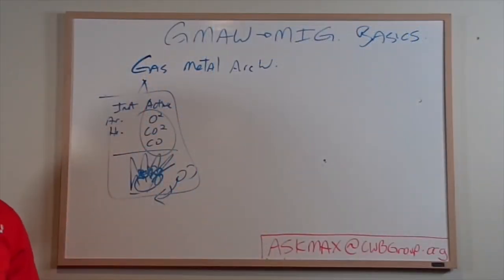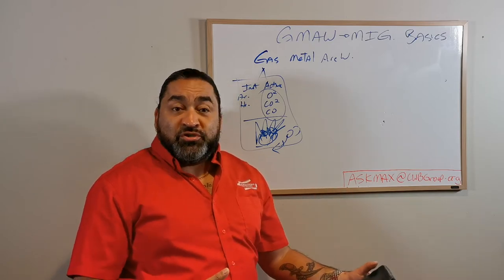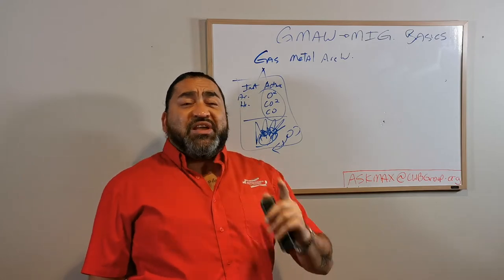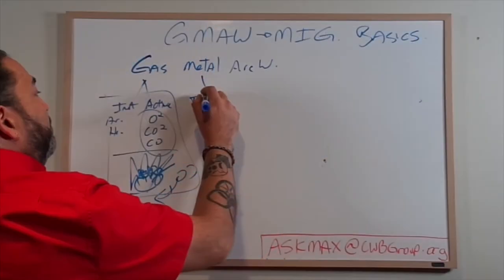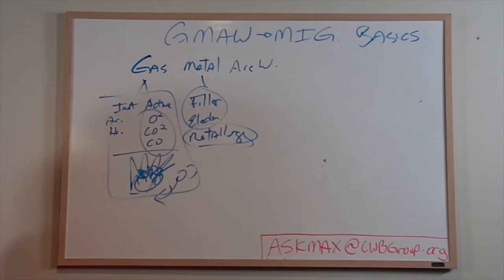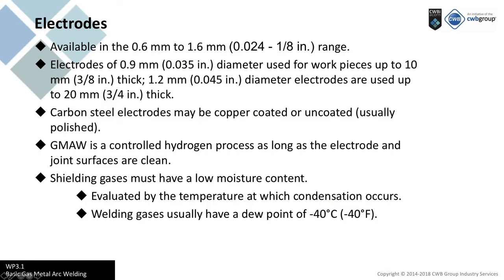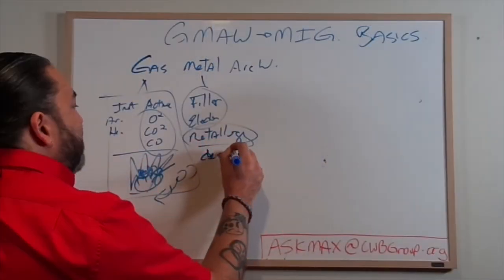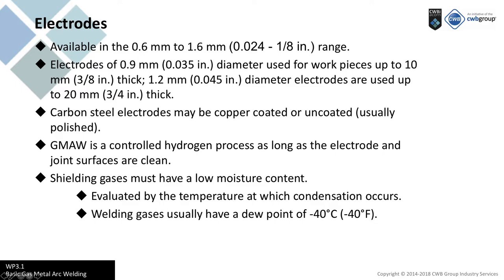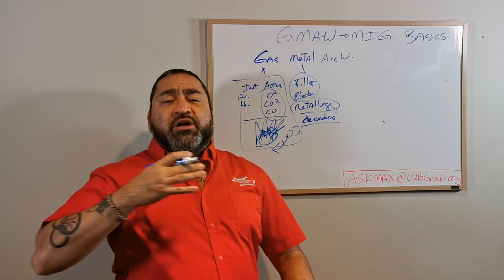This is still problematic. If I have oxygen in my weld, we've learned that it's going to lead to porosity or types of issues that have to do with oxygen inclusions in the weld. So why can we do it now? It wasn't because we invented new gases so much that made the big difference. The biggest difference in the world of GMAW was with the filler metal, or the electrode. The metallurgy of the filler wires changed - we have gotten better at creating deoxidizers. A deoxidizer is an element, mineral, or alloy that I can add to my wire, my ferrous metal, that will consume oxygen.